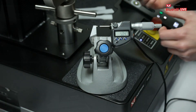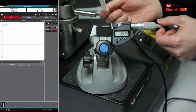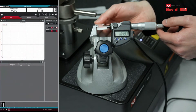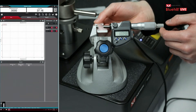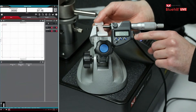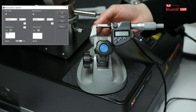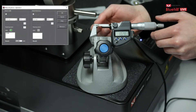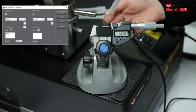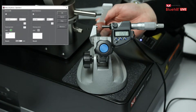No more adjustments to settings are needed. I'll start by measuring the width of the specimen — a standard dog bone. Open the micrometer, close it onto the width, and tighten down until you hear a click, which tells you it has reached the correct dimension. Press the red button on the side, and that populates a window showing all the measurements being taken. You can see two columns — initial width and initial thickness. The first width reading of 10.098 appears in the bottom left table, and the green light in the data indicator confirms it is measuring width.